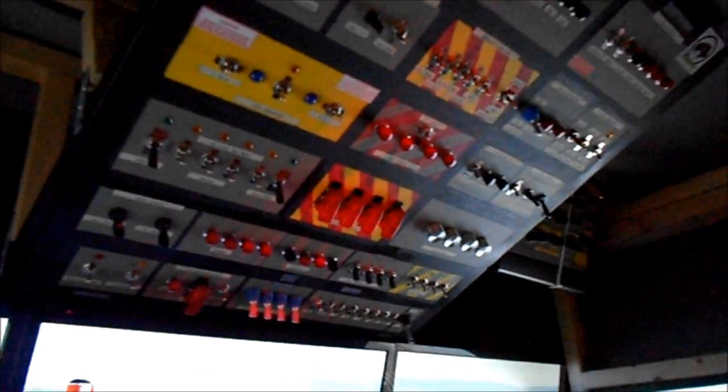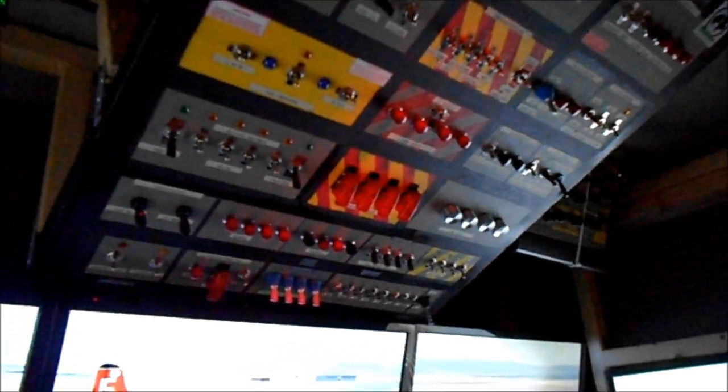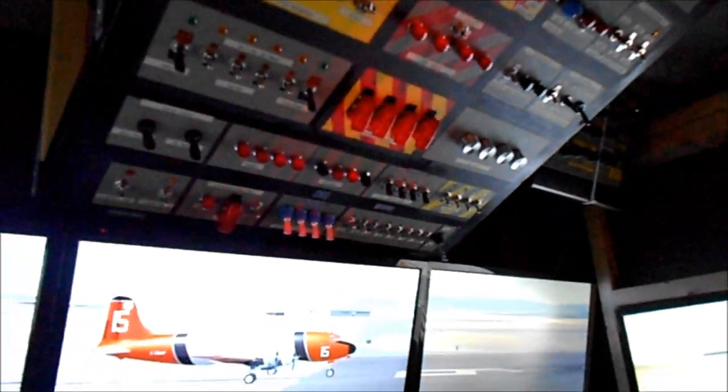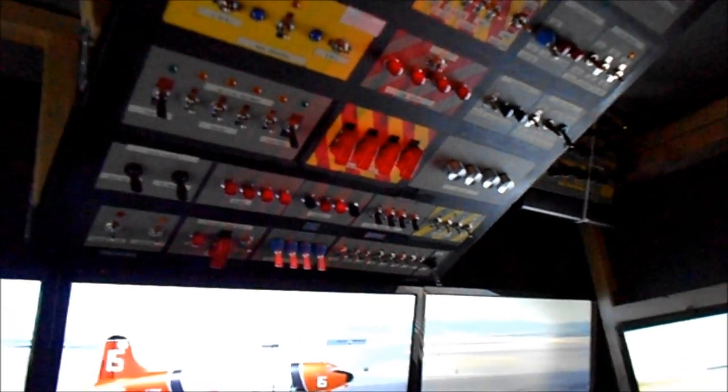This is built with three controller cards. What's a controller card? Basically, it's what you wire the switches to, and then you plug the controller card into your USB port, which makes your PC think you just went to the store and bought a controller. They show up as any other USB controller would, and then you just have to program your buttons and switches.